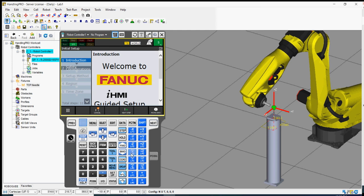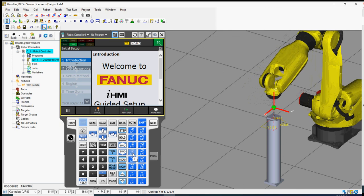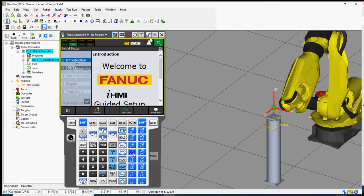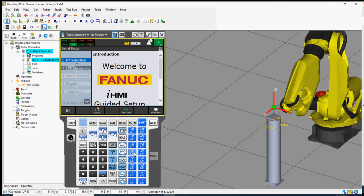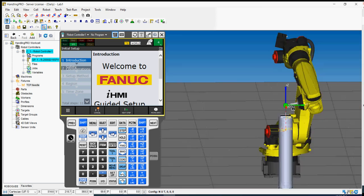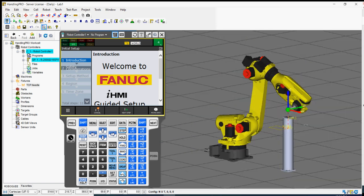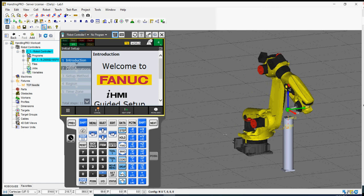We're going to hit the negative joint axis. I'm going to speed it up a little bit to get it to that position. Then I'm going to stop it and decrease the speed, probably about 4, and just keep doing it till we get it to that position. Okay, I'm going to stop it. And you can see that we're kind of where we have to be with picture number three, the third position. So now we're in picture number three. That's where the robot has to be.